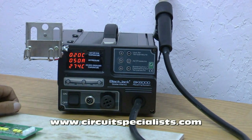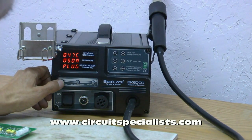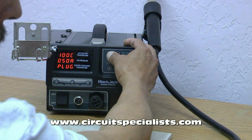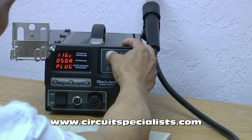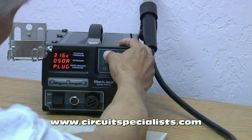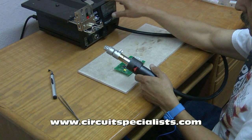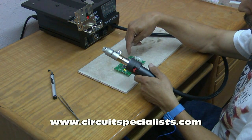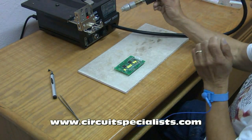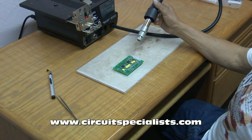I'm going to go ahead and turn the unit on. I've got several buttons to set this machine — I push the hot air gun button, then set the temperature and air pressure. These settings are pretty much trial and error, but from experience I know I need somewhere around 300 degrees for the hot air temperature. I usually like to use at least 75–80% airflow. More airflow means it operates quicker, but the higher the airflow, the more danger of moving other components you may not want to remove.